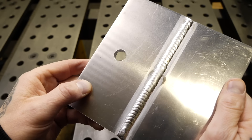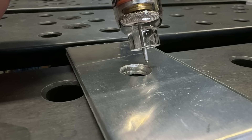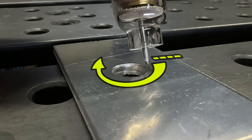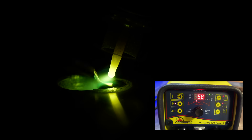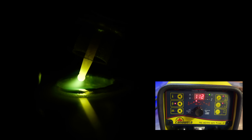So now we've got this hole here. Obviously we have to weld it and fill it up, so let's start from scratch. Here's how I would do it to take care of this problem. What we would do is pick a good spot to start welding. If you're positioned at your workbench like this, I would always teach to start welding at the top of the hole. The amount of heat we're using is always going to be different in relation to the material thickness, but essentially when you start, you just want to keep your arc focused on the edge.